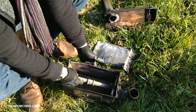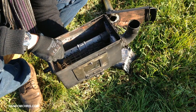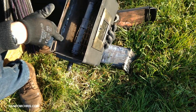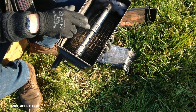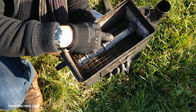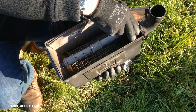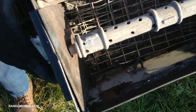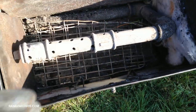The next thing is the secondary air pipe. As you can see, it comes in from the outside through a hole I made, runs across the back of the stove, comes up and then across — it's been drilled with lots of small holes. When the stove is operating, this draws in cold air from outside, which gets preheated on the way down across the burn chamber. The preheated air then rises and is expelled naturally through these holes. Because this area is just underneath the baffle, the secondary air reignites what would otherwise be smoke — the smoke burns on the way up past the baffle and across the upper section of the stove, producing flame just prior to going up and out through the flue.